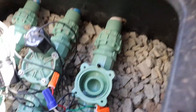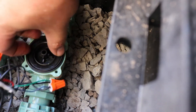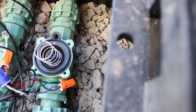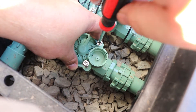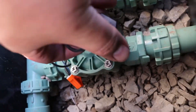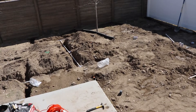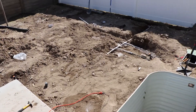Pretty cleaned out there. Let's go ahead and put the new diaphragm in there. Put the spring on. Now let's go turn the water back on — hopefully the water doesn't come out, that's the big thing. Water's on. Valves are off. Looking good.